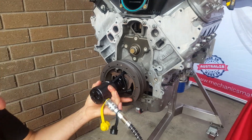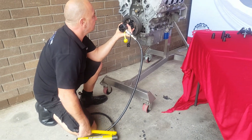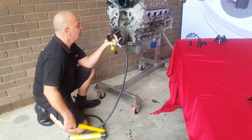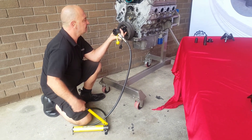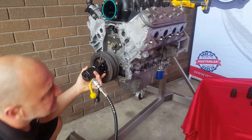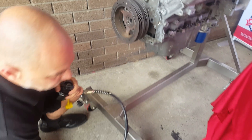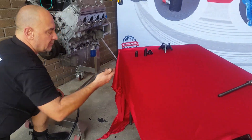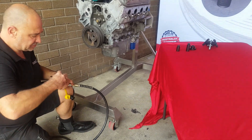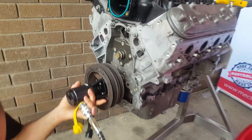Now we're going to have to take up the slack first. This cylinder is 10 tonne, which is fantastic when you have something very tight. Normally we don't need more than 5 tonne to do a job like this — on average it's about 2.5 to 3 tonne. You should check to make sure your piston end sticks out so that it will actually work and push against it.